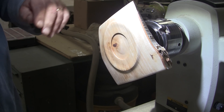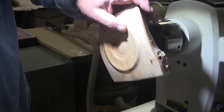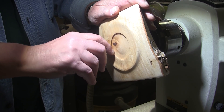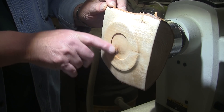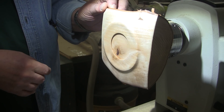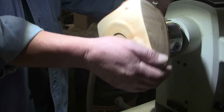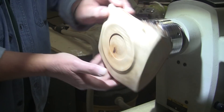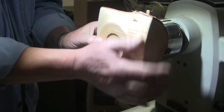Well, I have a decision to make. I've got two coats of sanding sealer on here now, with steel wool in between coats, and it's quite nice, quite smooth. But in sanding, I've reduced the depth of my recess — it's probably not much more than a sixteenth of an inch. I typically shoot for an eighth of an inch. So either I could make it deeper now and mess up my nice finish, or I can see if it'll hold. So that's what I'm going to do.